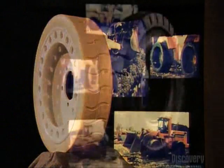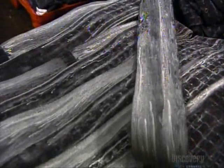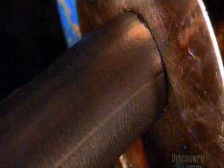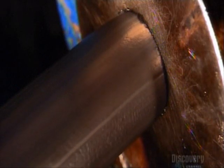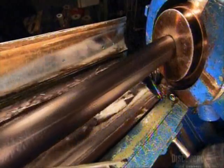No air in these tires means they're ideal for heavy work. They can move a lot of weight around without buckling. They start with a wide, flat strip of partially processed rubber. A hot extruder forces it through a series of holes, transforming the rubber strip into a narrower, rounder form. The rubber then falls between hot cylinders, which roll it thin and soft, like pie crust.